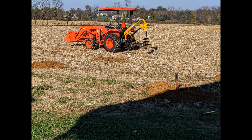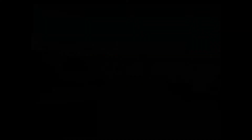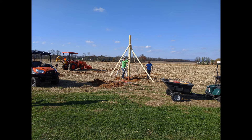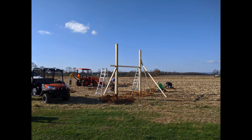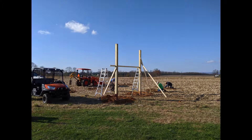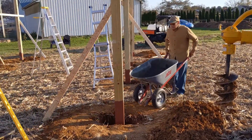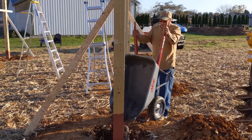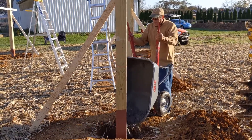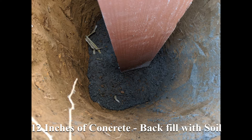There's a lot of limestone out there — it's a miracle we didn't hit rock out of eight holes. To start, we had to set the posts and make sure they're plumb, and we secured them with bracing. You can see our son Alex in one hole, which shows it's about four feet deep. We braced each of the posts as they went up and eventually there would be eight posts. Once the posts were set, we filled them with concrete. But before that, at the bottom of the post, we drilled a hole and put in half-inch rebar that stuck out one foot on either side of the post, and that would set in the concrete to give greater strength for lift.